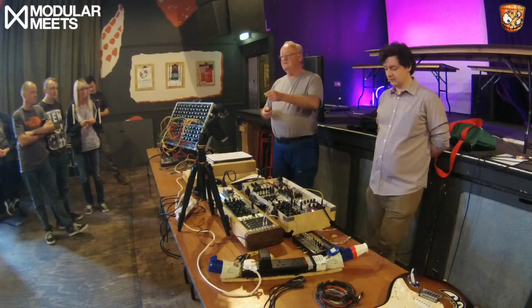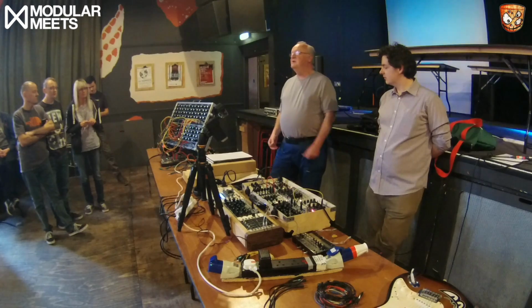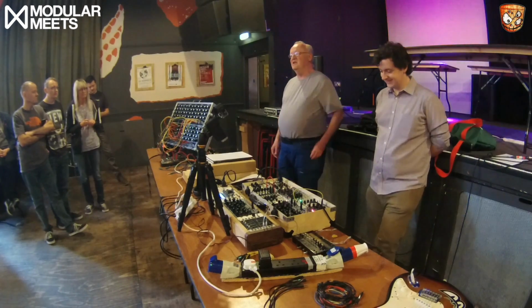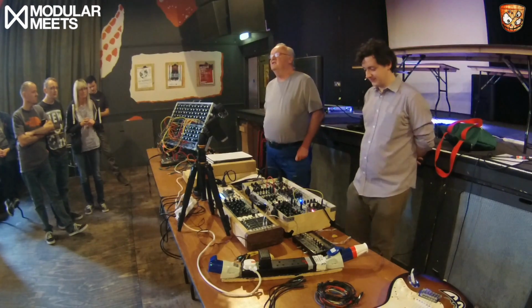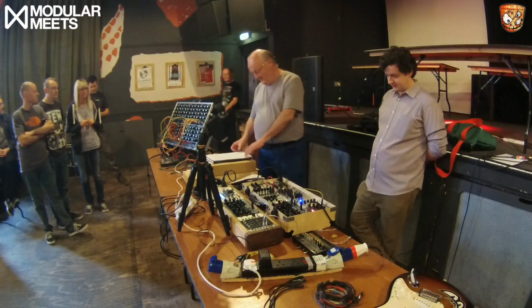And as you turn it down to 0, it adds the required compensation to reduce the second harmonic distortion to 0. But of course it goes further than the middle, and as you turn it clockwise, it deliberately does completely the wrong thing to add more distortion. And that's the DIRT control. You could call it second harmonic, but DIRT is what it's really all about.